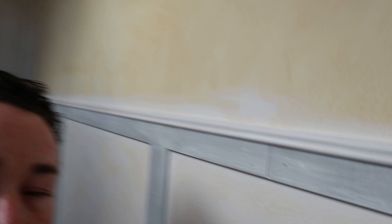When I come round with the filler — not today, this is nearly dry but not dry enough — I'll come back tomorrow. Any of these joints, I'll get them filled up. I've got some two-pack filler for the bigger ones, and some fine surface filler for the smaller puncture marks from the nail gun. I'll also go around all these edges, across the tops and the sides, and just caulk them all in.